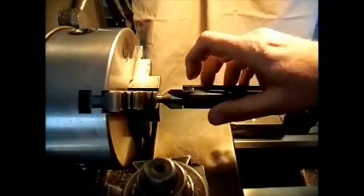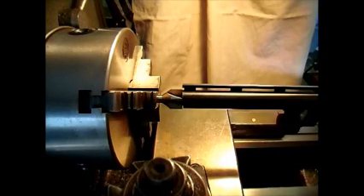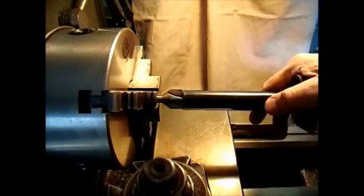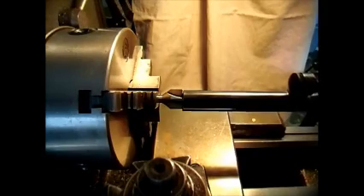When we cut this, we're going to cut it back so that it comes just flush with the front of that island underneath the rib — that looks a little bit better and will also help get us squared up since we're a little further back on one side. This is basically on center in the tailstock. I showed you in a still that I have a spud that I stick in the chamber that allows me to put a center on the barrel. Any barrel that has an extension on it — in shotguns they often do — that spud allows you to reach past that extension and still center the barrel nicely and control it.